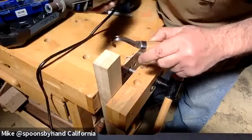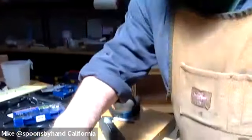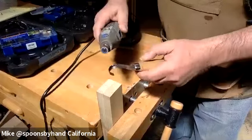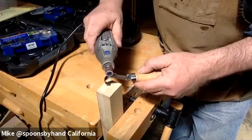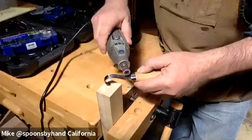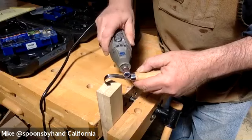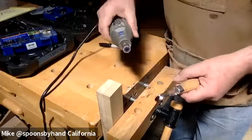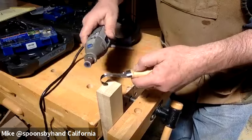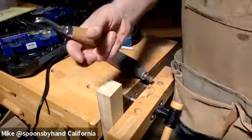So Michael, are you going back and forth or just from the top to the front, kind of just lifting it and going back down? Good question. Because this is a rotary tool, I'm going in this direction to cut, which is against the rotation of the cutting tool. And on the way back, I'm lifting up and coming back down. So it looks like I'm going back and forth, but I'm going forward and up and around, forward and up and around. If you ever use one of these tools, you'll find out quickly that you don't want to go in the same direction as the rotation of the motor. That's essentially true for all woodworking tools that rotate. Okay? Yes. Awesome. So I'll go back.